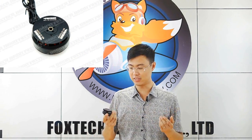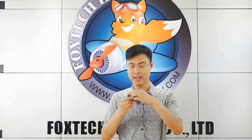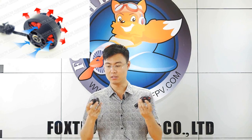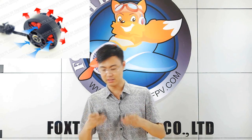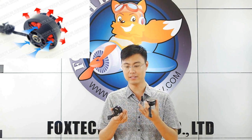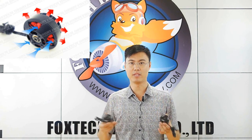This model really has very good features. First, you can see this model is quite nicely built — it actually has a fan on it. We sell it in pairs, so when you buy a pair, you get one motor rotating counterclockwise and the other clockwise. The fans have different rotation directions in order to draw cool air in from outside and expel hot air from inside, which really helps a lot to reduce heat generation in heavy load jobs.